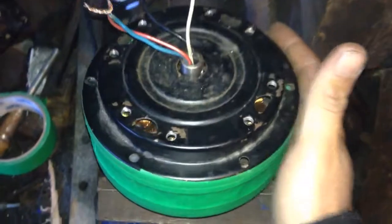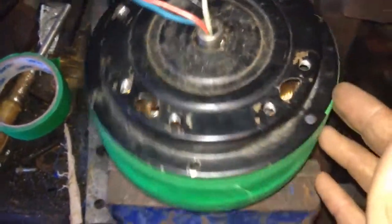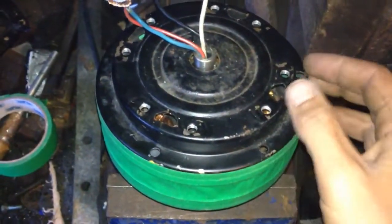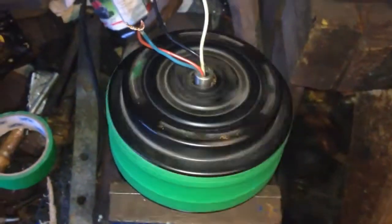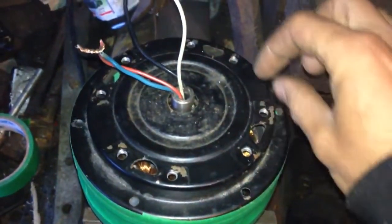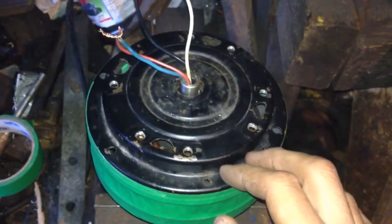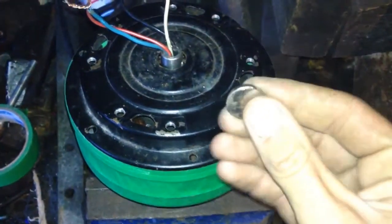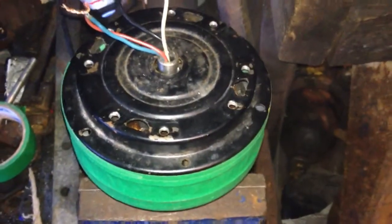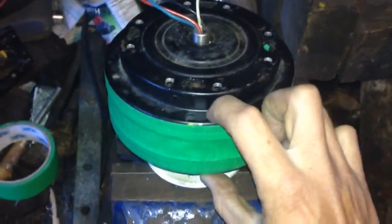Well, this is the ceiling fan, and I've got a bunch of magnets in there — I think I got sixteen magnets. It worked out pretty good because there's sixteen coils in there. There's a bit of a gap between the magnets and the coils but not much. I didn't have enough neodymium magnets, I tried to buy more and the store was sold out, so I'm using ceramic magnets, and the ones I'm using are pretty tall.